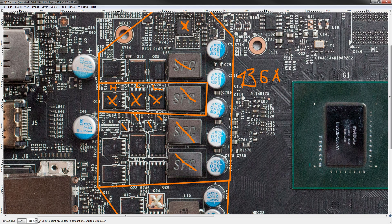I'm not saying you'll actually get that 132-amp pulsed rating, because it'll blow up before you hit that. That pulse rating doesn't specify the gap between pulses — it's for a 10-microsecond pulse, and in a GPU VRM application you're running shorter pulses repeated several hundred thousand times a second. They likely assume the MOSFET cools all the way back to 25 degrees between pulses, which makes that rating completely irrelevant for this VRM.